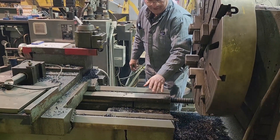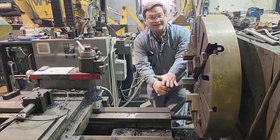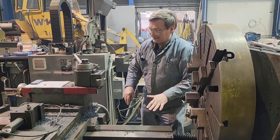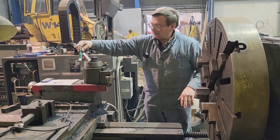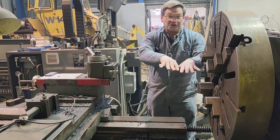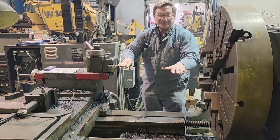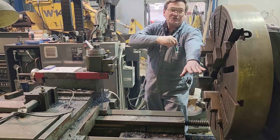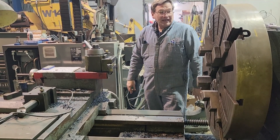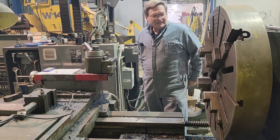So what I did was where the gap had been, we had bolts on there. I made a bracket underneath with a whole bunch of little pads that I could oil, and set screws so I could adjust where they came. Previous to doing this, I had machined the plate flat — it was torch cut, but I machined the bottom of it flat, and the top of it to fit the compound. Now we could come in here, and as you moved the carriage they would both move together with the U-connector between them, so you could come in and face them. I did a dozen of them that way, and they all got cleaned up.